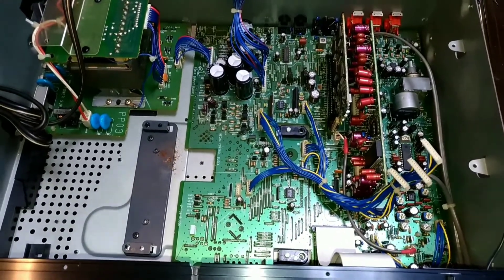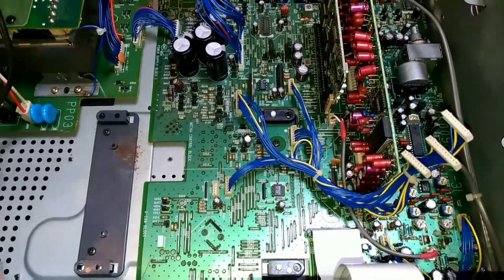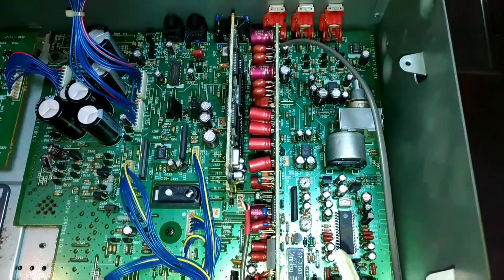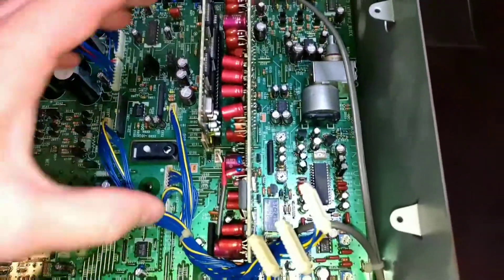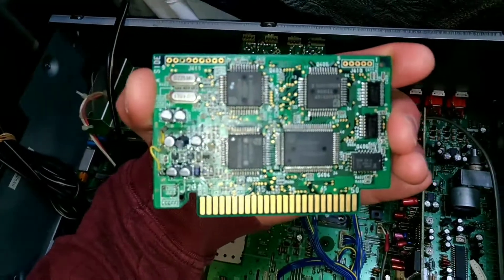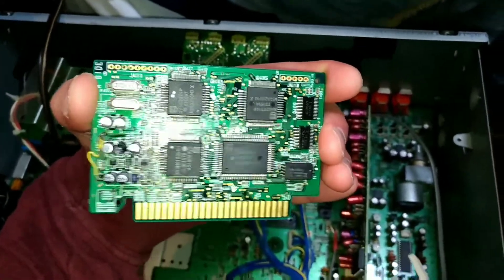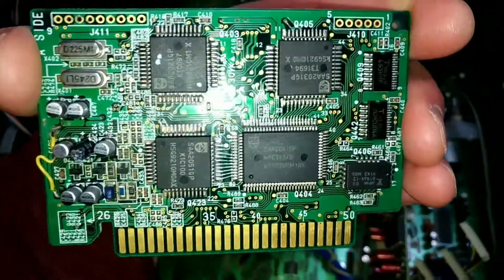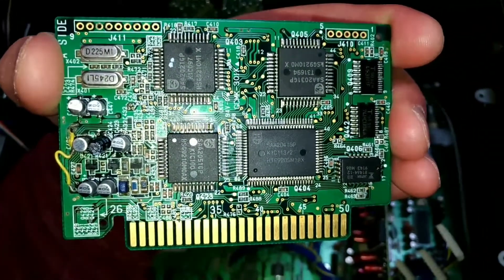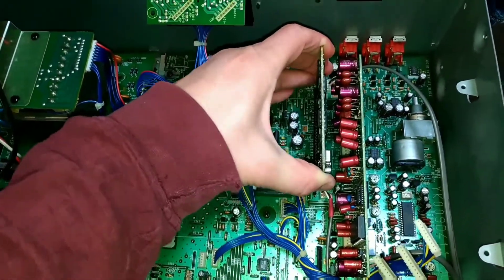Usually right in the middle would be the transport where the cassette is, but I've got that apart because I'm going to buy the belts for it tomorrow. This board here is usually covered with shielding — just two easy screws to remove. On the left side where the yellow wire is, I've changed all those capacitors except the non-polarized ones on the left side, which do not need to be replaced. This thing is working now.